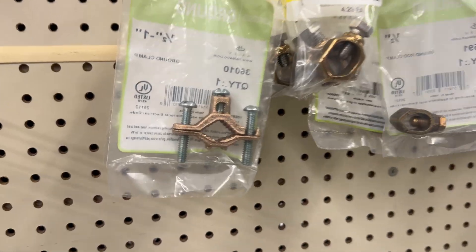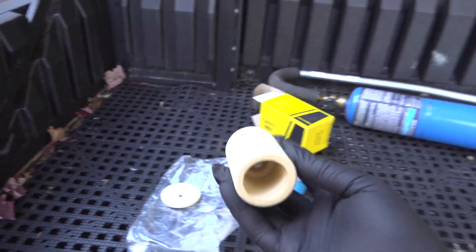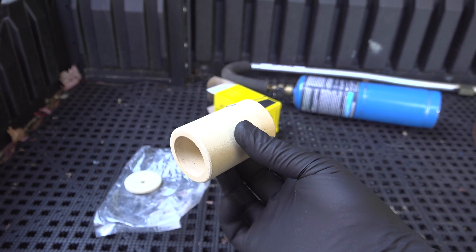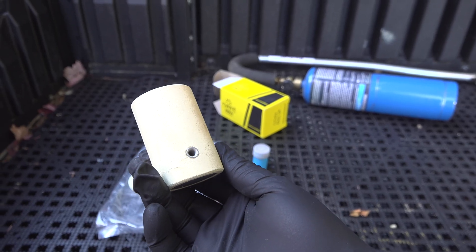There are many inexpensive clamps on the market — you simply insert the wire into the clamp, tighten them up, and you might consider the job done. I'm not going to use one of these clamps at all because when I'm done with this grounding rod, I want a permanent installation that won't corrode or get damaged. I can bury the whole thing under the ground and never have to worry about it again. The only way to get a connection like that is to weld the copper wire to the rod. Welding copper isn't easy, but fortunately there's an easier way you can do on-site with no special tools. You're going to buy this kit — many years ago these were called CADWELD, and now the company is N-VENT. All this is, is a little miniature crucible. This kit sells for about 25 bucks and it's only going to give you one use.